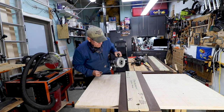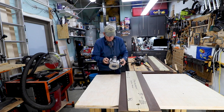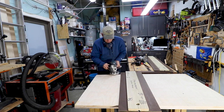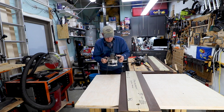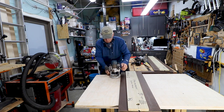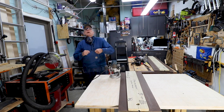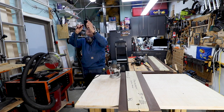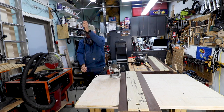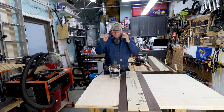I'm a little bit over, and that's all right. You just put a little bit less strain onto the dovetail when it does its job. So this is going to go a little bit deeper than 3/8. 1/8 for the track it's running on, and 2/8 or 1/4 for the depth into the workpiece. So let's see.